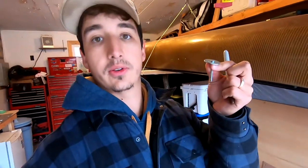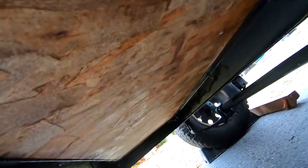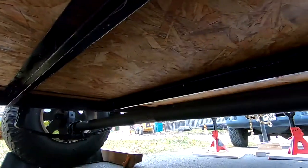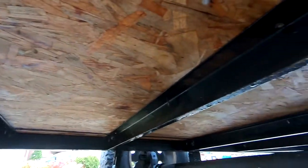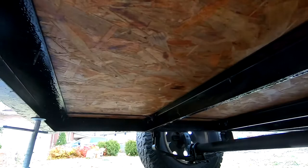Today I'm going to be installing insulation on the underside of my trailer. I'll be using inch and three-quarter wood screws with a washer, and hopefully that does the trick. Right now you can see right through to the plywood, so I'll be installing inch and a half to the underside of the plywood and probably spray foaming all the nooks and crannies I can't get to. Ideally I'd spray foam the whole thing but that's out of my budget.